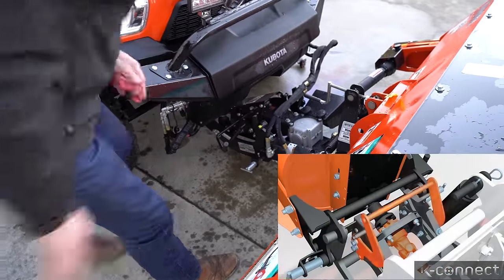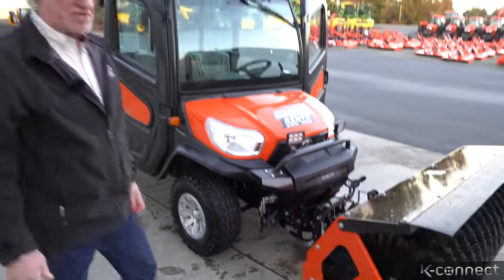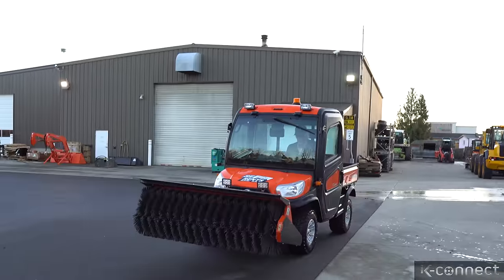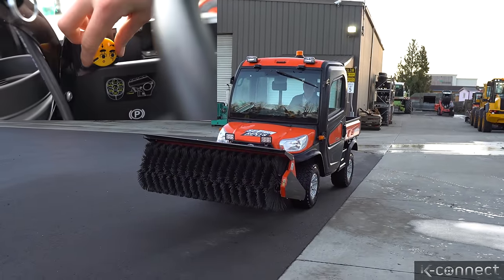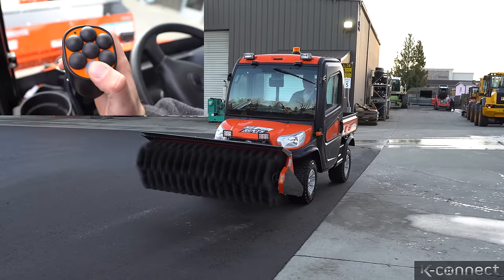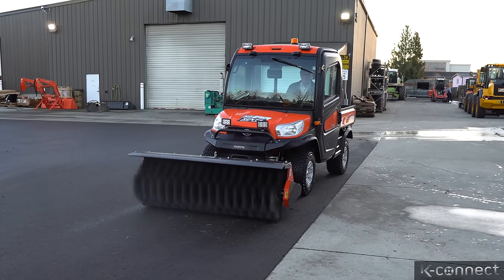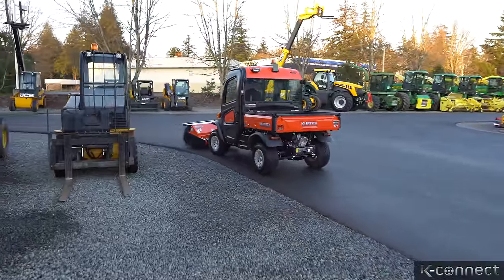Now all you do here is this pin — just go like that and now it's locked on. This is all you do to hook up the PTO. It's a quick connect and we're off to the races. If you're like me, you like to keep the rocks off of your driveway. You put it low and you turn the PTO on here. Starts it up — now you can click and you're scraping. You set the PTO throttle. And that's all there is to it.